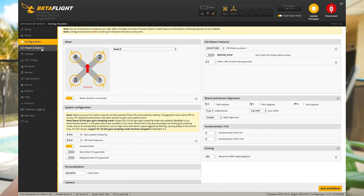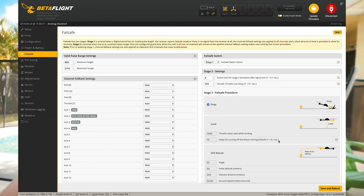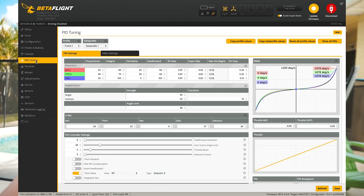Power, battery, and failsafe are all left at default. Here's where the magic happens — my PIDs are almost completely stock. I bumped up the D gains just a little bit on roll and pitch, and I dropped down the feed-forward on roll and pitch — that's it. For rates, I run kind of a high super rate with just a touch of expo. Rates are personal — run whatever feels best. I played around for a long time and have been flying this setup for a year now, so I leave it alone.